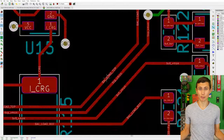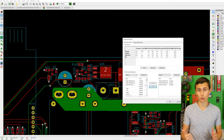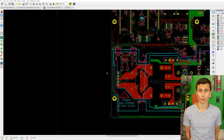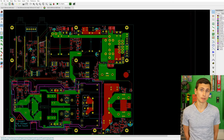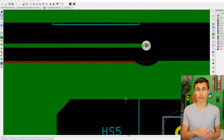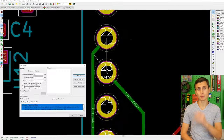We're ready to export our Gerbers, which capture all the details of the artwork — copper, solder mask, silk screen, edge routing — containing information about all geometries. We also need drill files giving hole diameter and location. It's helpful to align the zero-zero coordinate of all files to the same point; I typically use the upper left corner. Misaligned origins can result in scrapping a board because all drills are in the wrong spot. The last outputs needed are the pick-and-place file — giving x, y, and rotation information for the machine operators — and the BOM, telling AllPCB which components to buy, place, and where. We zipped everything up, sent it over, and AllPCB gladly took our money and got to work.